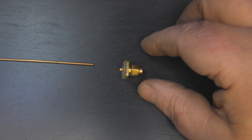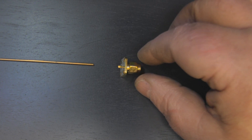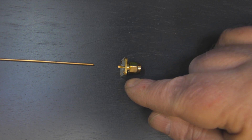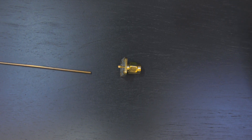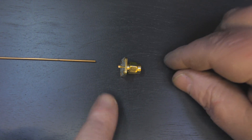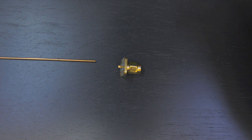This is a quick video that came about from a question on the Facebook group Antennas. The guy was asking how you go about soldering onto such a small solder cup, like on this SMA connector here. You don't want to use anything too thin — for a monopole you want a minimum of 1.5mm thick. This is some brass brazing rod I really like working with, and it's 1.5mm thick, but it's obviously too thick in diameter to fit into that little solder cup. So this video is going to show you how I do it.